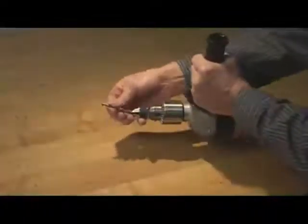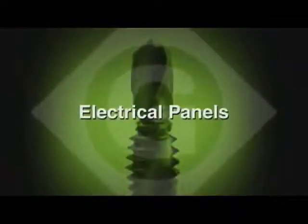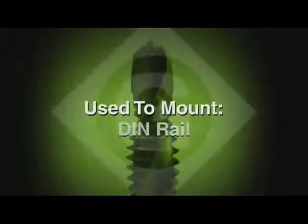As you know, with the older method, you had to search for a separate drill and tap that needed to be an exact match and the correct size. If the drill was too small, you would break the tap. And if the drill was too large, you wouldn't get any threads.